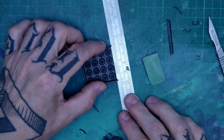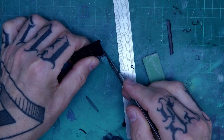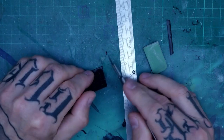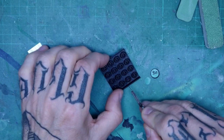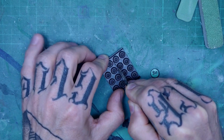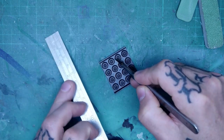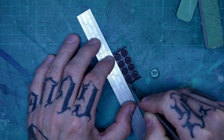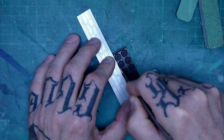You see the bevel edge to the base leaves an angle there. You can see it against the ruler. So I'll just lean that over to just shy of 90 degrees, and then with my flat sanding block, I'll sand them flat. I'm just making a little mark there between the circles. You can't get anything there to measure, so eyeball it. If you're not confident, use a little pencil and then go in with the knife. The Mark 1 human eyeball is pretty bloody good. It looked right, so I carried on going.